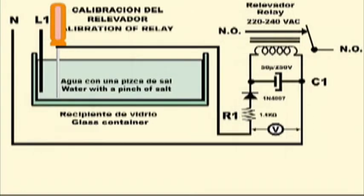A simple way to calibrate this gadget is to use an AC voltmeter and a glass container with slightly salty water, which has a fixed electrode and a movable electrode — a screwdriver used as a cursor to vary the resistance. With the screwdriver touching the fixed electrode, presenting a resistance of 0 ohms, the reading on the voltmeter can be, say, 125 volts AC.